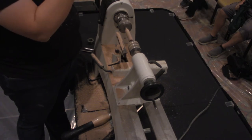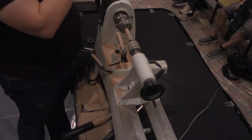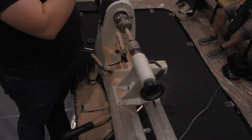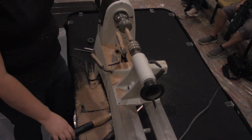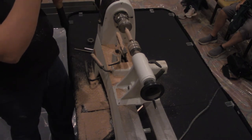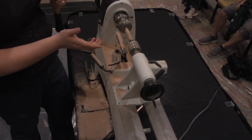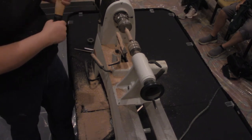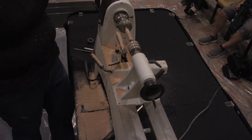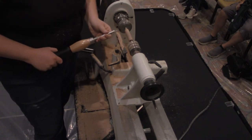But what I started doing after that was turning just the body enough so that it would seat into the cap a little better, so I would get a more flush glue up, so that I can make sure the cap insert is seated all the way. Honestly, the biggest thing people do with these is they don't insert the little black threaded insert for the cap far enough into the cap blank, and then the little edge of the hardware shows on the body blank. That's probably the number one thing I see as far as quote unquote mistakes. So it's the idea just to cover that up? If you don't want to, for aesthetics, then sure, that's fine. But the intent is to do that. So that's probably the number one thing I see.